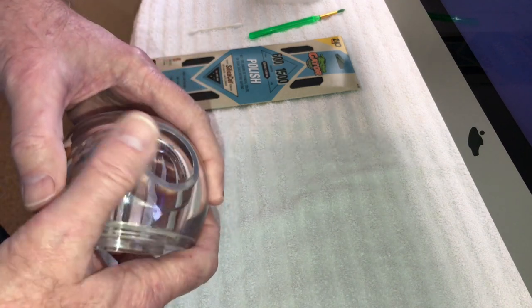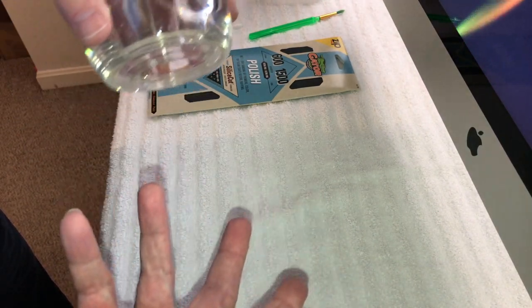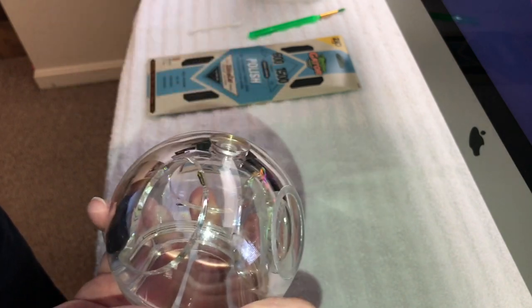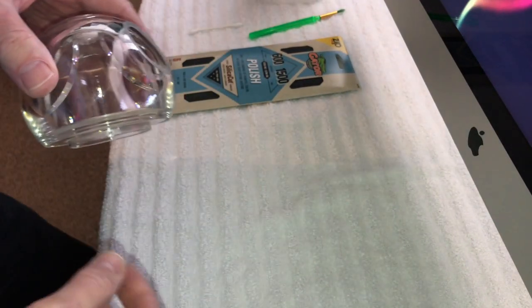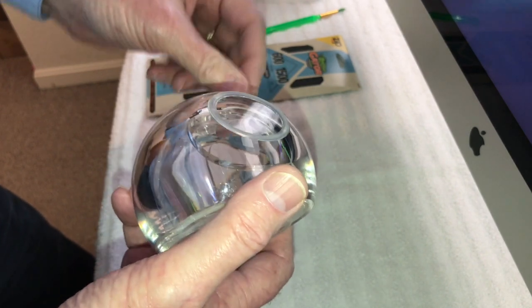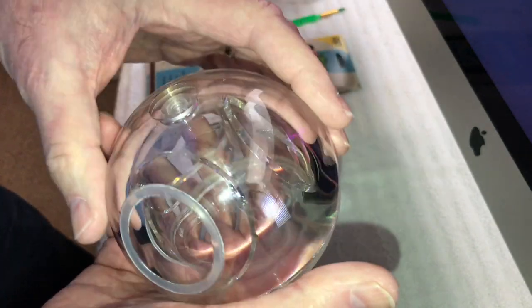And in between, you can actually use rubbing compound to get the fine scratches out, even a regular automotive rubbing compound. We're going to use Meguiar's. It's for headlamp enclosures, the covers over your headlights. Those are usually made out of polycarbonate, and they get scratched up. They yellow notoriously because of the ultraviolet. That stuff takes the yellowing right off. It's a very, very fine abrasive, and it will polish this up amazingly. However, there are a few scratches that it will not take out.